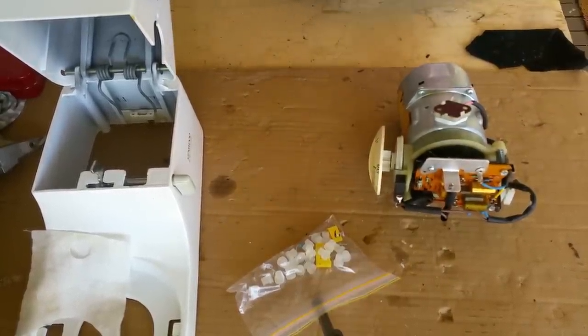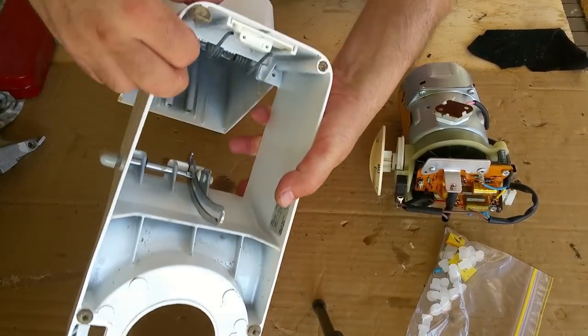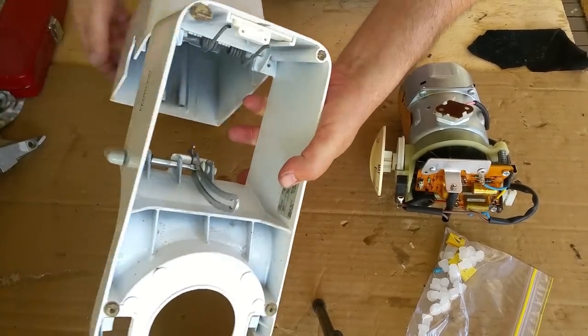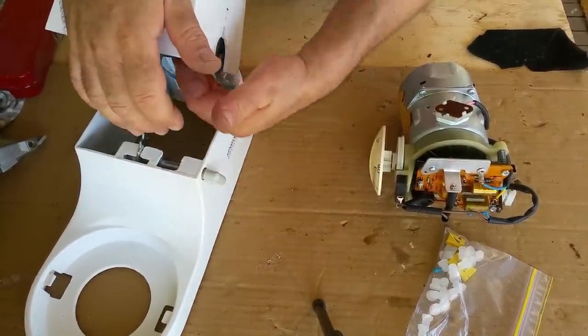Now, the other thing which Kenwoods are problematic for is breathing. Cooling, and that is brought about by the feet. And these ones are all smudged up. See that? No good. Those two, they aren't too bad, but I'll do them as a set. They use air underneath, which that would have had a beard, for cooling in the motor.